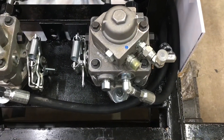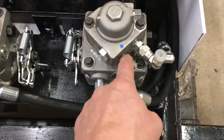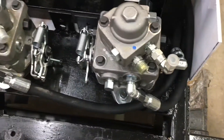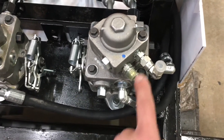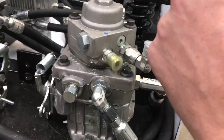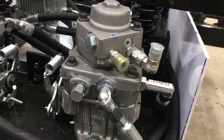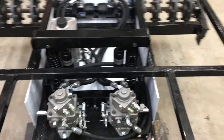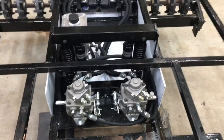The last fittings I'm still missing are these 90s here. These are actually o-ring dash-four, so they're even smaller than the rest. I need to find an o-ring dash-four that will go to a 3/8 flare fitting, and then it's going to loop up and come back down in there — that should relieve most of the stresses on the hose. That'll be another trip to the store. Anyway, that's about all there is for now on getting this all set up.